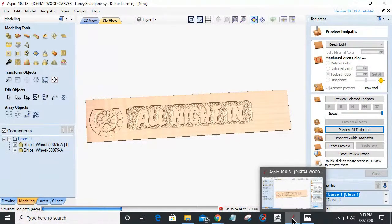Now, when I'm doing something like that, if I have to take the board off the table, with me, I have a fence, so if I take my board off my table, I'm able to put it right back where it goes. But if you don't have any kind of fence set up, alignment pins work out great. You could just drill 2 holes through your wood and into your wasteboard, and you can use alignment pins to make sure that board goes exactly back where it was before.